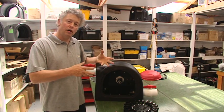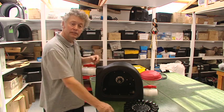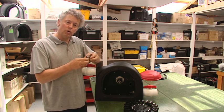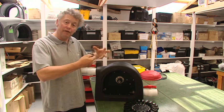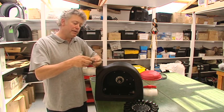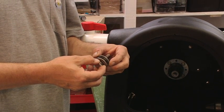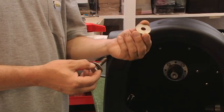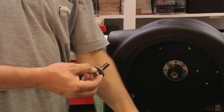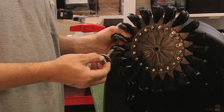In this step we'll install the Pelton runner onto the front of the shaft using the bolt, packing washers and the flange washers that you removed off the bearing assembly and block when you first stripped it down. I'll take off the packing washers that come supplied, then I'll remove one of the large flange washers off that bolt, put that down and I'll pick up the Pelton runner making sure the orientation is correct.